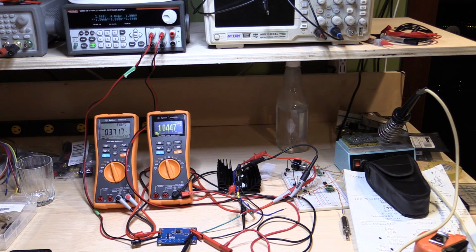So I would imagine that certainly with a 3 amp output load, even from right down at 4 volts through to 18 volts, it's going to be able to sustain an output voltage that is extremely close to the set point and extremely stable from what I'm seeing so far. So kudos to Richtek for putting together this evaluation board. So far it seems to be working very, very well. I guess the next thing to do now is to hook up a scope and my signal generator and see what it's like for output noise and also transient response.